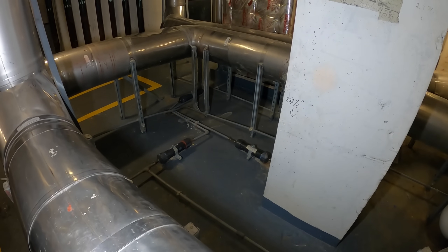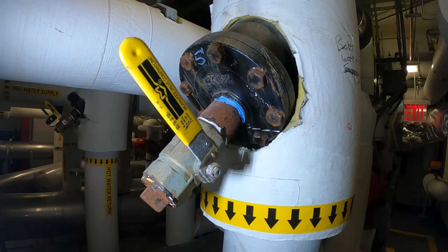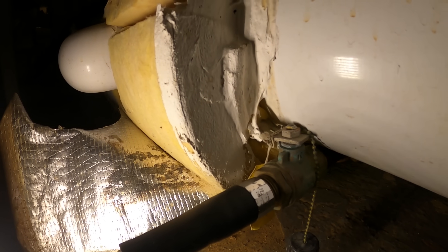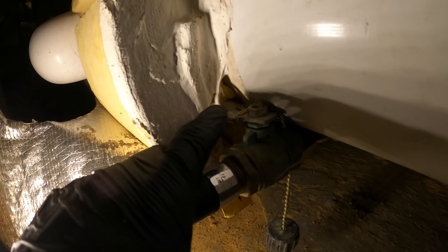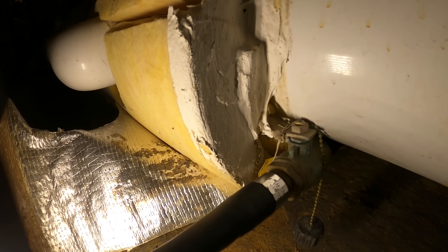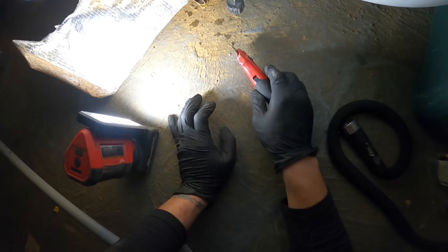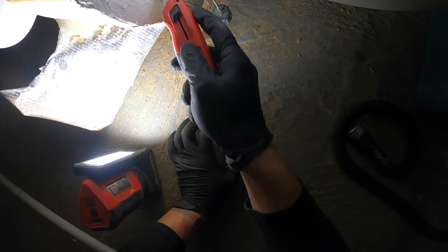Once we confirm that the valves hold and the water stops, we can open up this cap here and get to our strainer. So I connected my hose here and ran that down into the drain. But it looks like nobody ever used this because — look — the valve handles are in the insulation. I've got to cut that out to be able to use it. Makes you wonder if anybody ever pulled these strainers. Let's cut this out just neatly, just what we need.